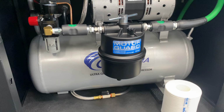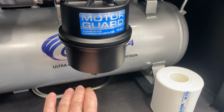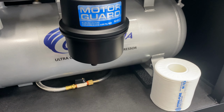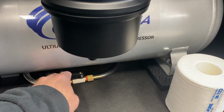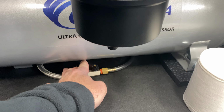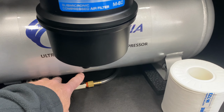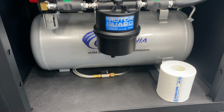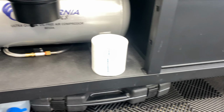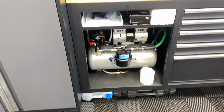Oh, the other thing I did, which I think is kind of cool, is you have to drain your compressor every time you use it, or you shouldn't leave it without draining it. And unfortunately in this tank the drain was on the other side, so it was very difficult to get to. So now I've got it plumbed, and it goes down underneath my cabinet so you don't see it. In this case it's open, but when I'm ready to put the compressor on, I just close that, and voila. Fill it up with air, and then when I'm done, I open it, and automatically the excess water that's in the tank spews out at the very back, and I don't see it, don't hear it so much, and that's worked out really well. So I'm happy with what I've done with this compressor here.